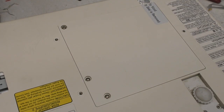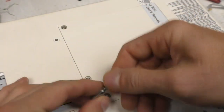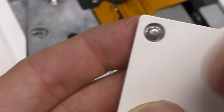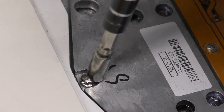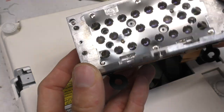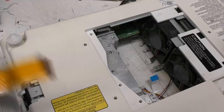On the bottom side there's a cover with a warranty sticker — this is the laser assembly, designed to be a replaceable item. These use another oddball screw type with notches, but a standard nut driver gives enough grip to undo them. For screws that are too tight, just use needle-nose pliers to start it, then finish with the nut driver. The whole laser assembly lifts out, and we can see an array of 24 laser diodes and a ribbon cable assembly, plus a mirror array that directs all the beams into the same place.